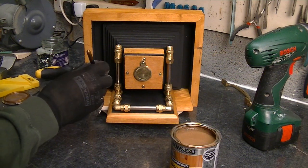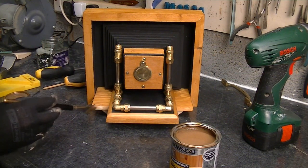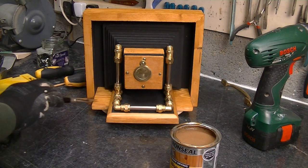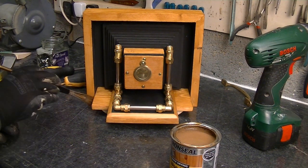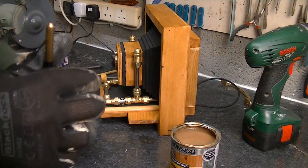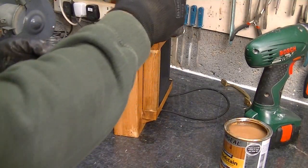This varnish has its own problems — if you don't go with the grain you leave all the brush marks behind. I'm not very happy with the final finish. Because it's quick-drying, if you go over a space two or three times from edge to edge on wood, it dries too quickly and when you put on the next coat you get streaks. I'm going to have to finish this off with a spirit-based varnish. You can see where the glue residue was on the timber — the water-based varnish hasn't taken and it looks rather cheap and nasty.